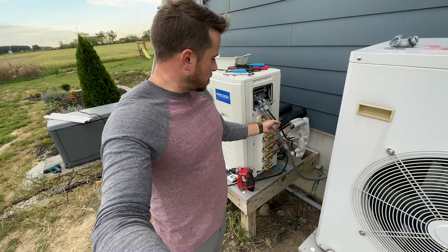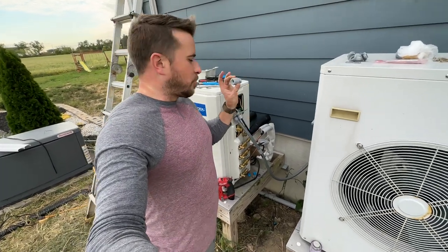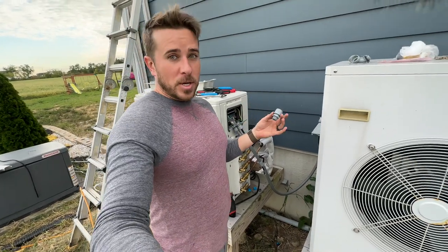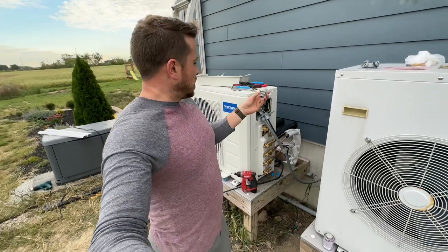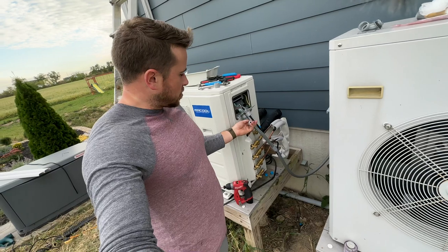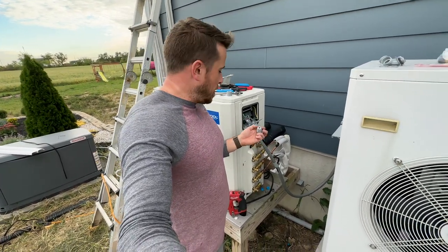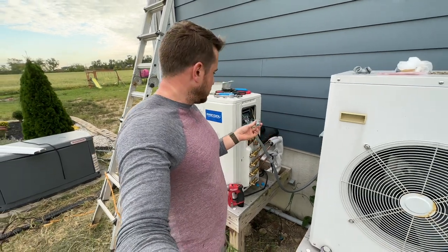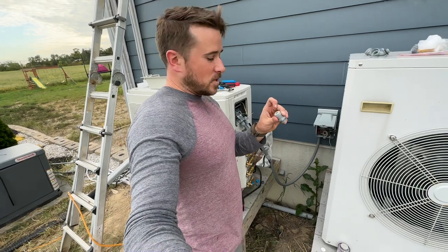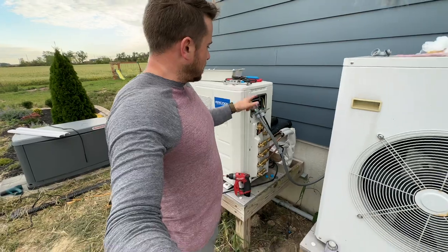This fitting here is what I'm using for connecting my indoor unit cord whips — it's a half-inch cord grip connector. Previously on the other unit I used metallic ones, but this time I found non-metallic ones and they were a little bit cheaper. You've got this cap, and inside there's a rubber seal gasket that seals right around the cord and keeps weather out. These cords are a little bit big so it was kind of a pain to get through the rubber gasket — it's a very snug fit on the black part of the wire — but I got it on. That's B, and I've got to get the second one on for C.